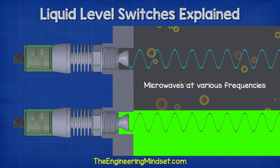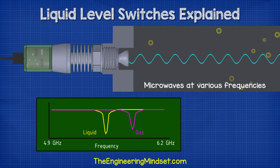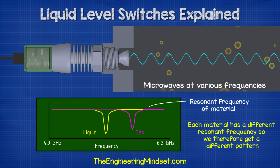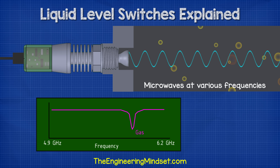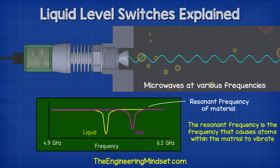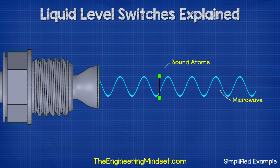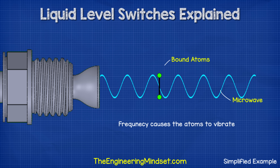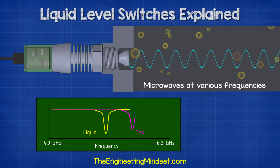The device uses a technology known as reflectometry which emits a microwave of various frequencies from the sensor and into the fluid. These rebound back to the sensor with a pattern. Each fluid and the different states of the fluid create a different pattern. The pattern is the resonance frequency of the fluid and each material has a different resonant frequency so we get different patterns. Liquid has a much lower frequency compared to gas so we have these different plots. The resonant frequency is the frequency that causes the atoms of the material to vibrate. The sensor emits a microwave at a certain frequency over some atoms which are bound together. As we vary the frequency through the spectrum we find a frequency that causes the atoms to vibrate. As we continue through the frequency spectrum the vibration stops. By measuring these vibrations of atoms across the frequency spectrum we can plot this pattern.